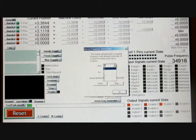The X on the vinyl cutter is the horizontal movement of the head unit. So if we select X, we can now select a step frequency. I wouldn't try going too high initially with this. On the small CNC mill I can go as high as 10,000, but we want to keep it fairly low, so I want to do tests around about 500 Hz.